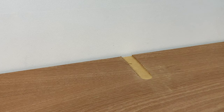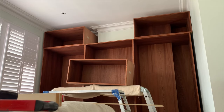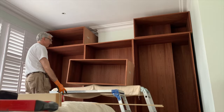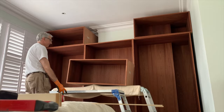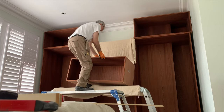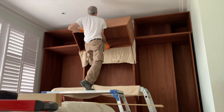The center wardrobe is fixed to the wall with low brackets set into grooves routed into the wardrobe top — I've shown this process before on other wardrobe builds and it still works really well. Next I have to get the top boxes lifted in. Over the years of working alone I've developed a technique for getting these into position — it's obviously better if you can arrange help, but that isn't always possible. I do the lifting in two stages with two platforms set up at different heights. I lift the center top box onto the taller platform closest to the wardrobes, protecting the front edge with a dust sheet, then carefully make the next stage of the lift to get the back edge of the top box onto the carcass so the carcass bears the weight, then lever it up onto the top.